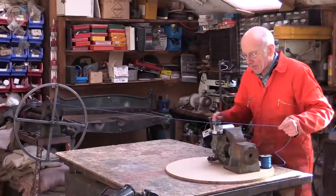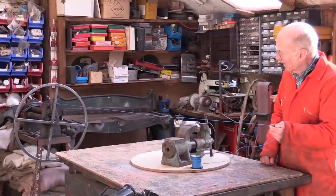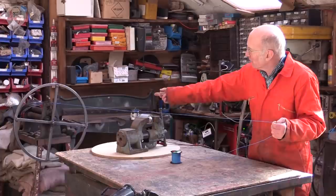So I'm not using the capstan motor here. But now if I apply a little bit of pull here, it's extraordinary what happens. It's enough to move this massive vice, or rather ship, across to the dock. So what a capstan really is, is a torque amplifier. The small amount of pull that I'm putting here is translated to a much, much bigger pull, pulling the vice across.